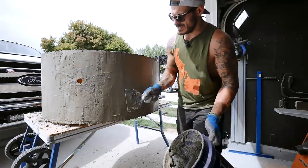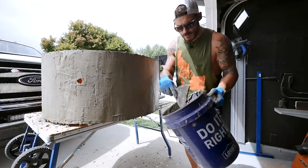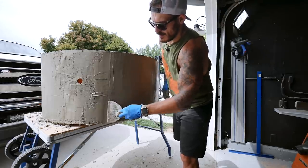As you can see, this is the rough side and this is the finished side. The way I did it is I just diluted the thin set with flex bond far more — so far that it falls off like water. Once it evaporates, it will give us a more uniform finish.